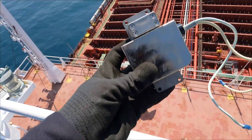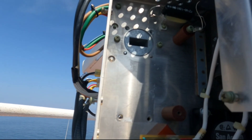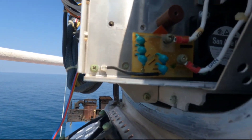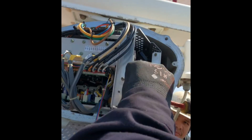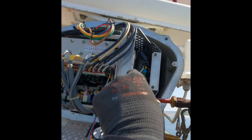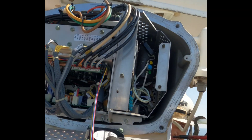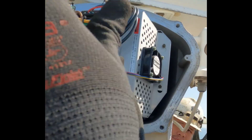It's a very simple job — the only point is to focus on the procedure. This is the magnetron location where it was installed. Install the new magnetron here — you can see I am fixing the new one and carrying out the connections as well. Once the connections are done, make sure the wires are not touching any body of the scanner unit. Then put back the cover and screws and close up the scanner unit box.